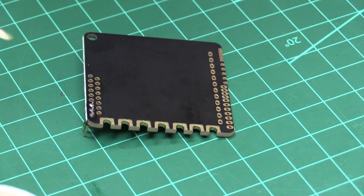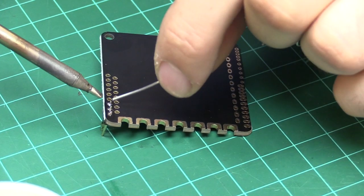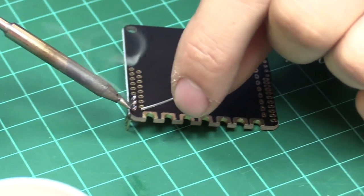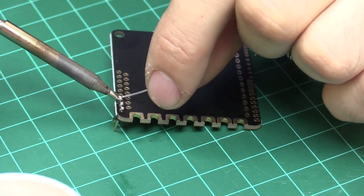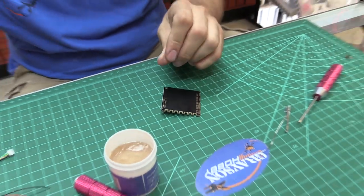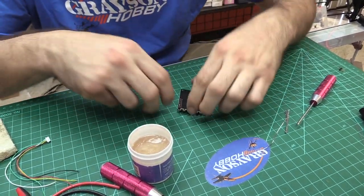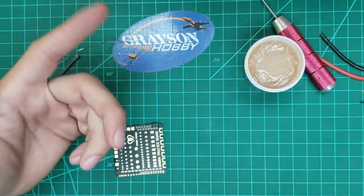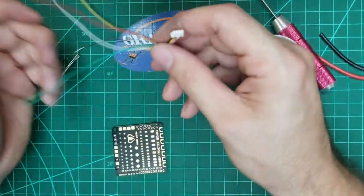So what are you looking for when you solder? You want a nice shiny solder joint. If it's dull, it's not a good solder joint. And you want a really hot iron — you need a good wattage iron. You can't use garbage from Home Depot or Walmart; you've got to get a real good iron. A good iron is going to go much farther. Another common one is like the RxSR wire harness and stuff like that.